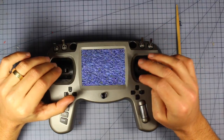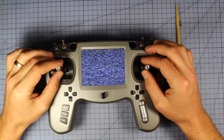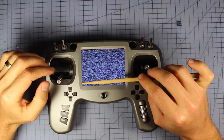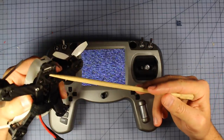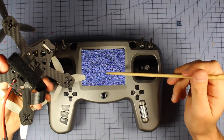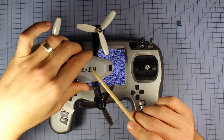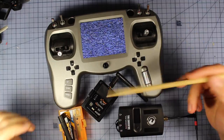Something worth pointing out is that you can't actually adjust any of the curves — throttle curves, rate curves — in the radio itself. I spoke to Trappy at Team Black Sheep about that, and the reasoning is that when you adjust the throttle curve on the radio, you lose a lot of resolution. You're much better off adjusting it in the flight controller. There is an option for certain model types that can't adjust it in the flight controller, where you can change it on the radio. But for most things it'll all have to be done on the flight controller — and to be honest, that's better practice anyway. That's where you should be making all your adjustments, leaving the radio as stock as possible.